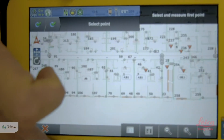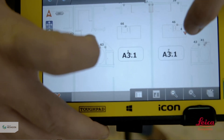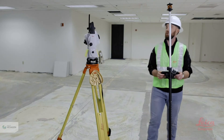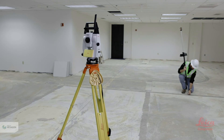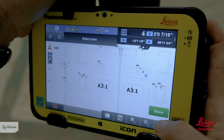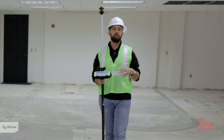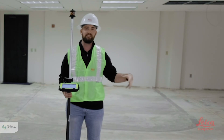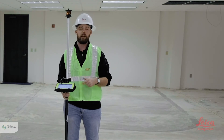It's telling me to select and measure my first control point. On the map I'm going to find my first control point, tap on it to highlight it, and walk over to it. I'll place the field rod directly over my point and then plumb it up. After it's plumbed I'll hit the store button and record that point. It's really important to keep it as plumb as possible — if your control is inaccurate, your whole layout is going to be inaccurate. Not holding the guide rod plumb enough is the number one thing people mess up.